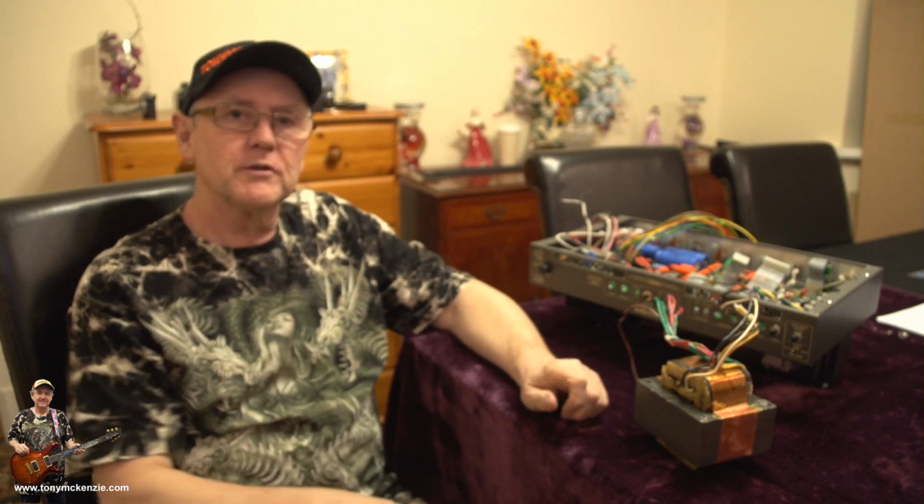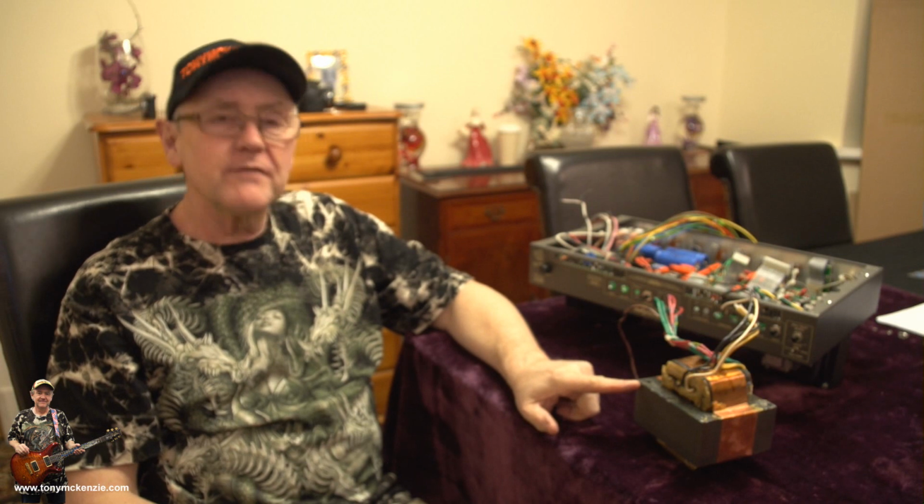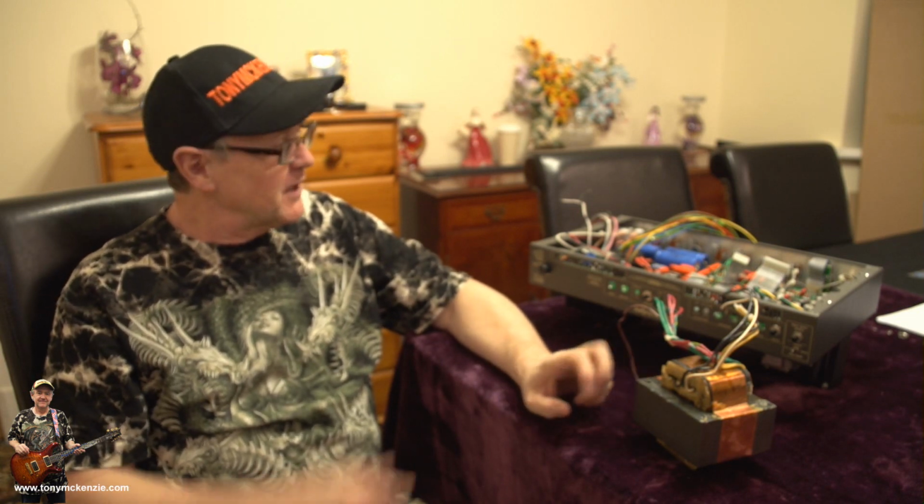Hammer a bit more with a drift, if you know what a drift is. And then put your screwdriver at the other side and hammer away. And you'll find they'll give a little bit. And you hammer away until you smash the heads off. Now, the end cover does get a little bit bent, but not that much. So the magic thing is, that saves you about 2 hours.